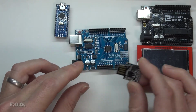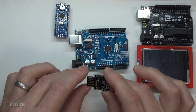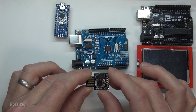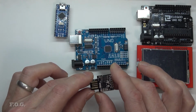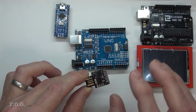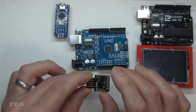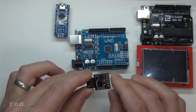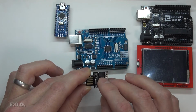So the way the bootloader goes is you hit the program button on the programmer. It says plug it in. You have to dash to plug it in. The minimalized USB host temporarily, I assume, boots up as a limited USB serial host, and the programming session occurs, and then it kicks it off. And the bootloader, when it's not actually being used for programming, when you just power it up, is actually pretty slow to get to the stage of running the program. I find the delay to be quite long.